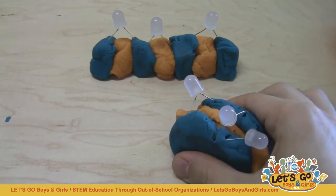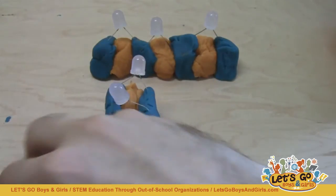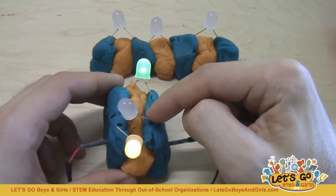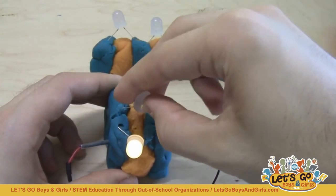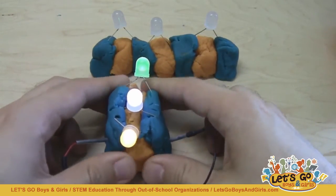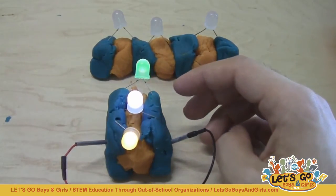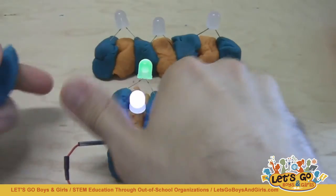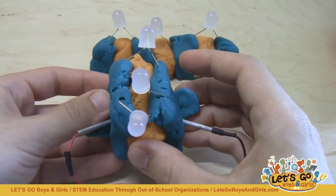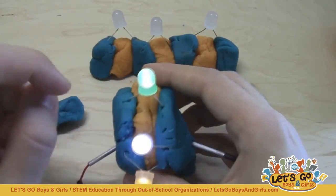To conclude the video, I'll go through a few quick troubleshooting steps. About 90% of the time, the most common problem when students say 'mine's not working, it's not lighting up' is just that they have an LED plugged in backwards. So the first thing you can always check is just flip the LED around and see if it lights up. Double check for short circuits — they might look at something and say 'this LED isn't lighting up, I don't have a short circuit there,' but it could be because they have a short circuit somewhere else in their model.